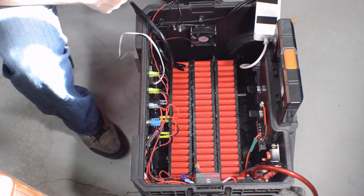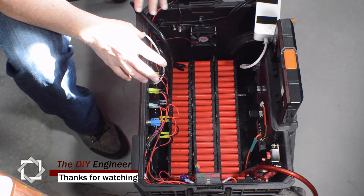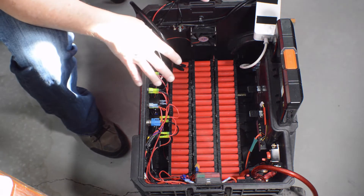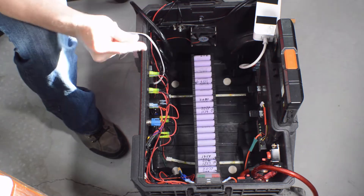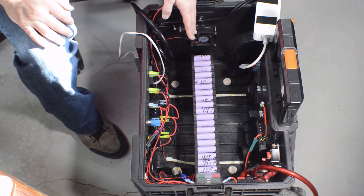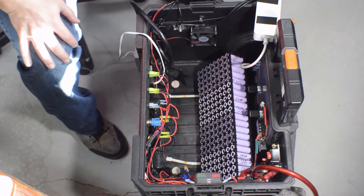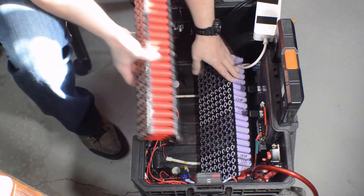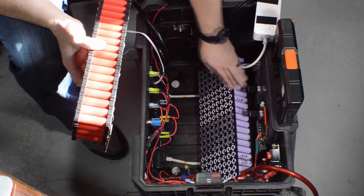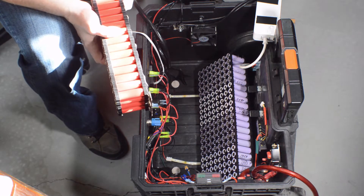The first part of this is I needed to strip out all of the wiring and my inverter and get things prepped. So I'm going to pull out these three cell banks, these three separate batteries that I've built out of 18650 cells, and I'm going to upgrade them to this. What I want to do is actually have three of these in here. These are a lot more cells in comparison to what was in there — each of these banks. So I'm going to have three cell blocks like this instead of just three like this. It's actually twice the cells. If you were to stack these, there's actually two of these in each one of these bricks. So basically I'm doubling the capacity. I have more cells now so I can do that.